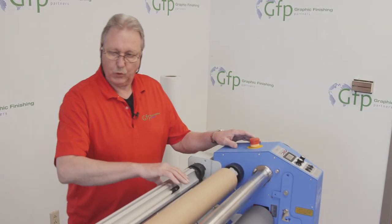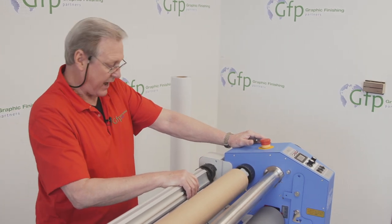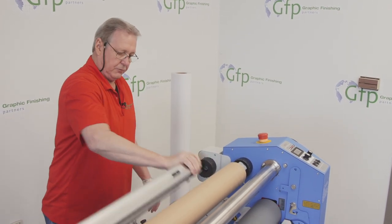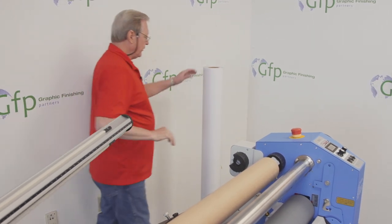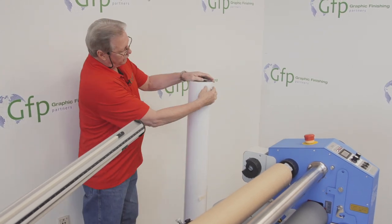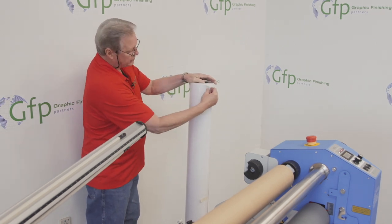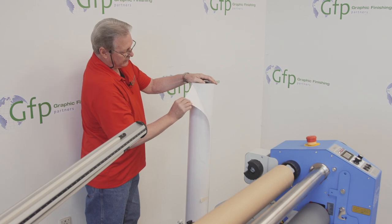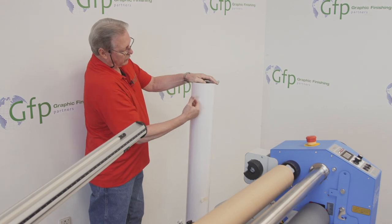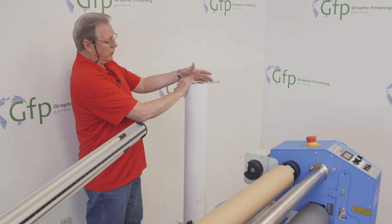This application is known as roll-to-roll, where we're going to put an over laminate on top of an adhesive back vinyl that's been printed with our images. There are two ways that film is wound on the core, known as poly-in or poly-out. In this case ours is poly-in, meaning the liner is on the inside of the roll. Poly-out means the liner is on the outside, and it would be loaded in the opposite direction.